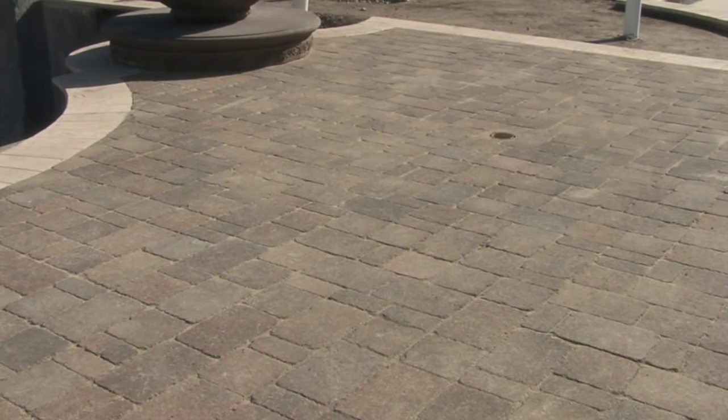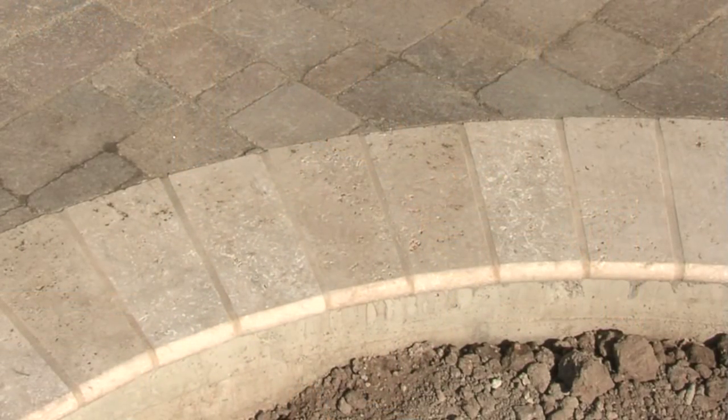The pavers are installed over a four-inch gravel base, then there's about an inch or two of sand, and the pavers set on top of that. To lock that in place, we use stabilizing sand that gets plate-compacted into the top of those pavers, and the outer border on the pavers is what's called wet set, meaning it's set into a concrete bed and locked in place.